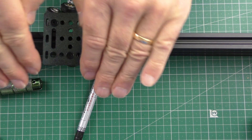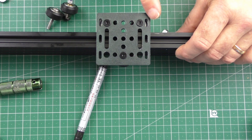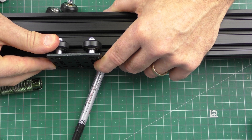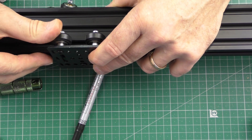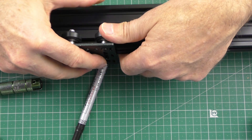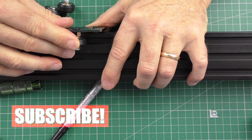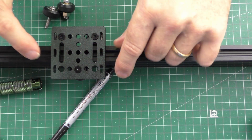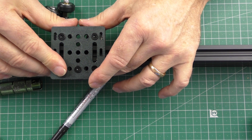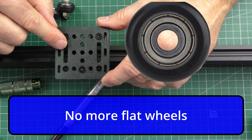I can no longer rock it this way. Now tilting it — that's firm. It can still move on its own steam and then stop. Another test I like to do when it's on the printer is what I call the slip test: I'm holding the carriage and I can just turn the wheel without the carriage being pulled out of my fingers. That gives me a good indication — I can move the wheels without the carriage being pulled along. The pressure is enough to keep the carriage from wiggling, but not so tight it gives me the flat wheel syndrome.